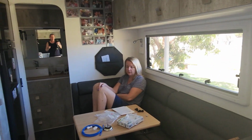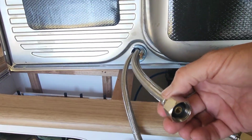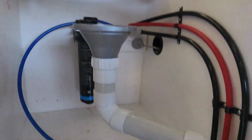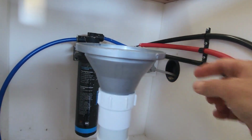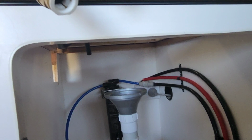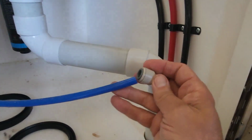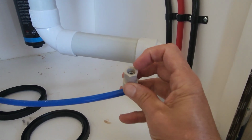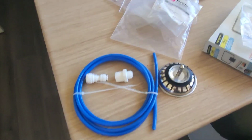We just had some lunch. I had to go down to Tucky's Mitre 10. The drinking water side of the tap goes from the black, which looks like 1/2 inch, down to 10 millish, but the fitting doesn't fit. That's the standard fitting that goes on there, and I couldn't get an adapter to go to that. So I've had to adapt it basically.